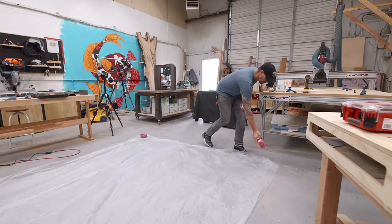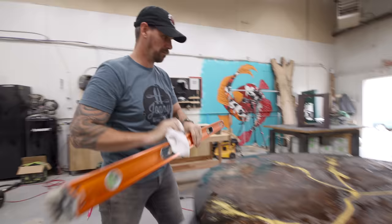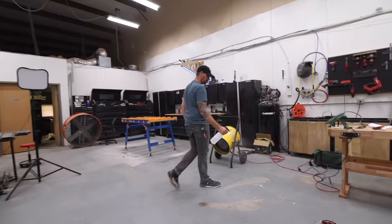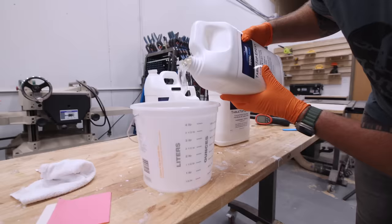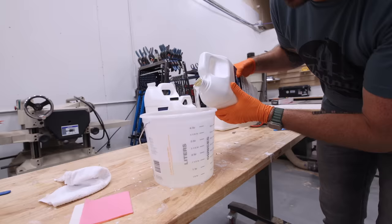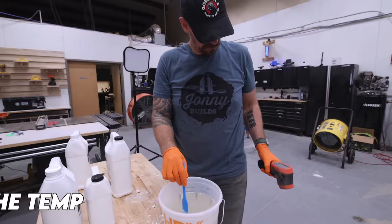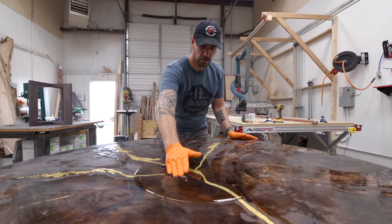It's super important to have as clean and dust-free a shop as possible because any tiny hair or dust particle floating in the air will inevitably end up in the epoxy — that and flies and gnats, which seem to love epoxy. Another thing I really love about tabletop epoxy is that it's a one-to-one mix ratio, which makes it easy for those who are math-challenged like Jeff. I stirred this epoxy for almost 10 minutes, mixing slowly to prevent stirring up extra bubbles before the pour. I started the pour in the middle of the table and worked my way outward, spreading it out by hand.